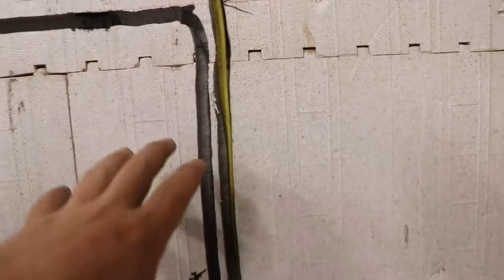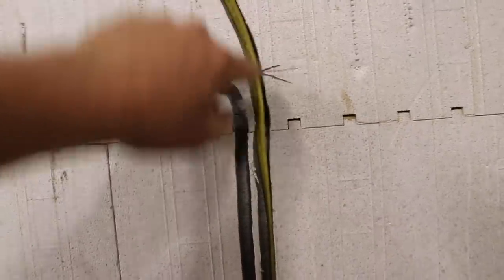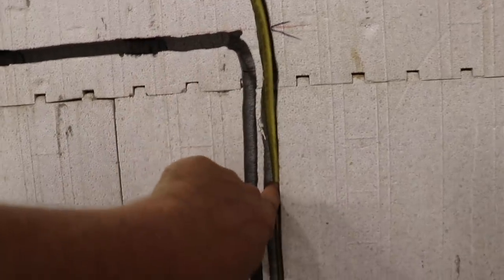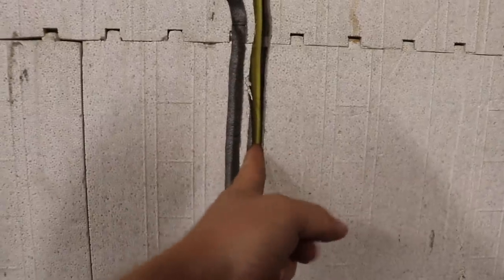And when we get around to securing this wire, which we're gonna do into the concrete, we'll try to get that wire turned flat so that it's as deep as it can be, because when it's turned like that, it's actually sticking out 1/2 inch. So there's actually only 3/4 inch of foam there, and that's not at all what we want. Okay, back to work.